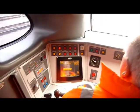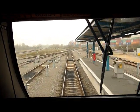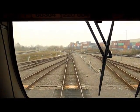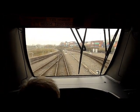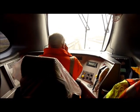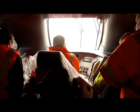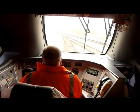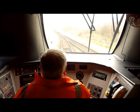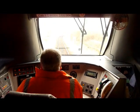10 miles an hour is the speed limit on the depot. So we just run around at this sort of speed. That's just the degree of power that you're putting on — more power as you go up towards the notches. Unless you've only got one or two engines working under a maintenance condition, because then if the track is a bit damp you will get wheelspin.